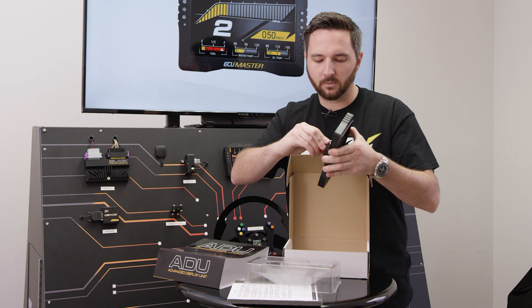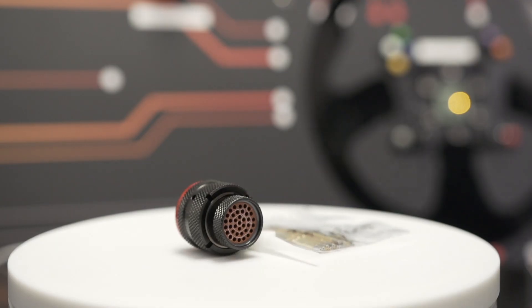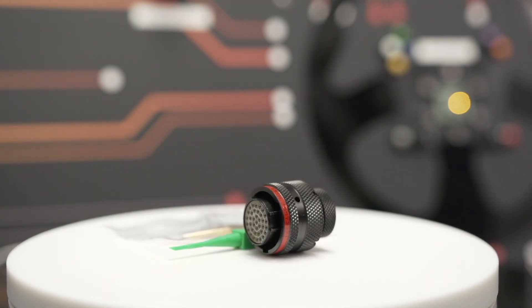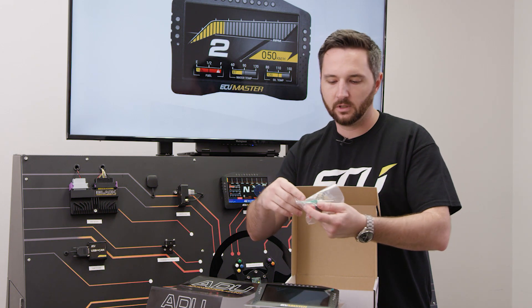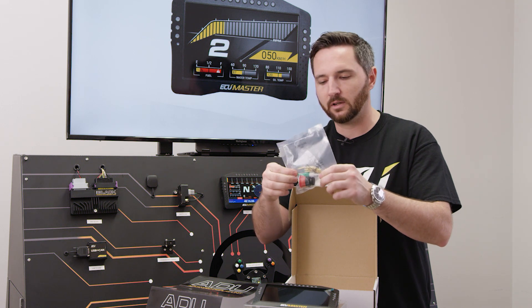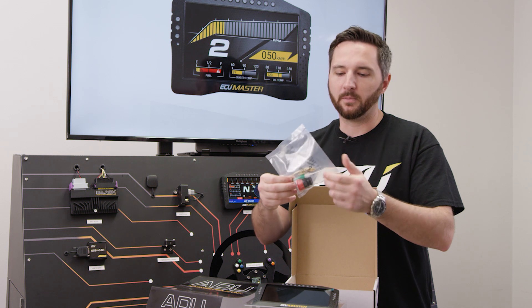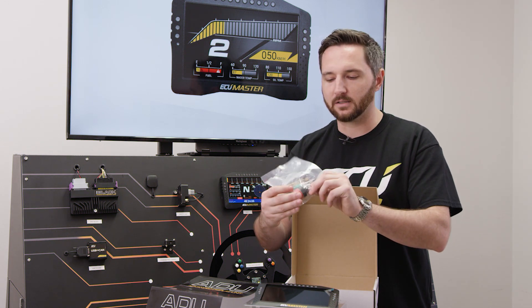Extremely small, very easy to install and release. It's knurled, meaning there's texture on the outside of this connector, so it's really easy to rotate the locking collar. You'll find the connector with terminals. You've got a pinning and depinning tool — these are a little bit sacrificial. You'll be able to use these enough for one connector before they start getting chewed up. That's intentional — they're made out of soft plastic so they don't damage the release for the contact inside the connector.